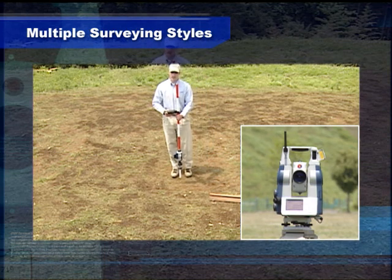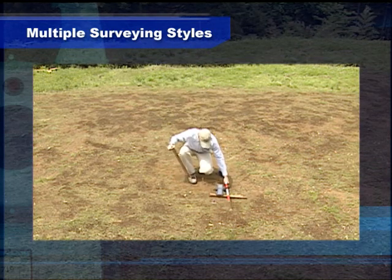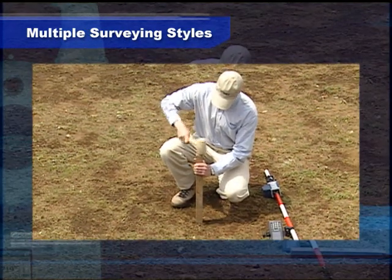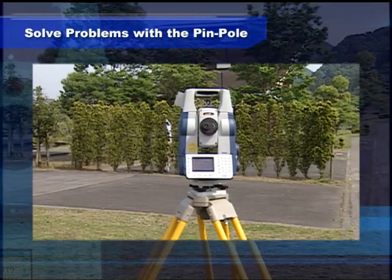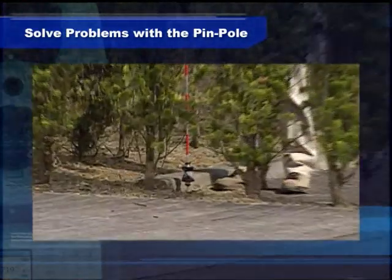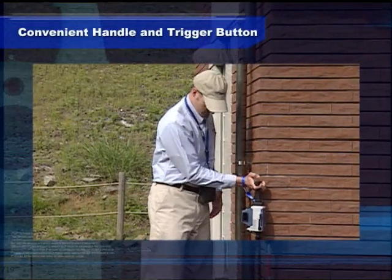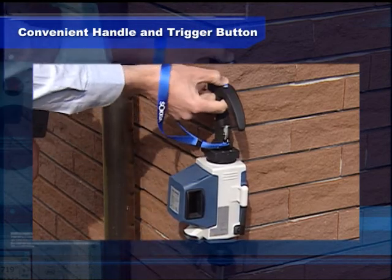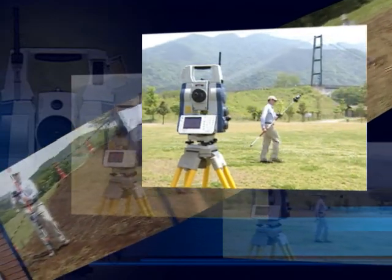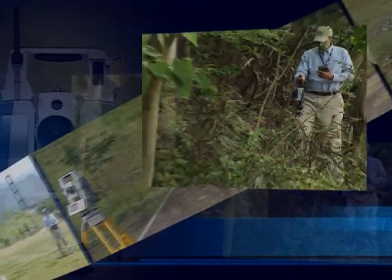The prism and on-demand remote control unit can also be attached to the bottom of the pole for staking out. By placing the prism close to the ground, error resulting from a leaning pole is reduced, allowing staking out to be performed with greater accuracy. Sokkia's industry-first small-diameter pin pole makes it easy to measure along walls and corners where prism placement is often difficult. The unique handle features a trigger button — simply press the button to automatically sight, measure, and record data. This gives you the unprecedented freedom to create your own style by selecting the right pole and prism setup depending on user preference, type of survey, and site conditions.